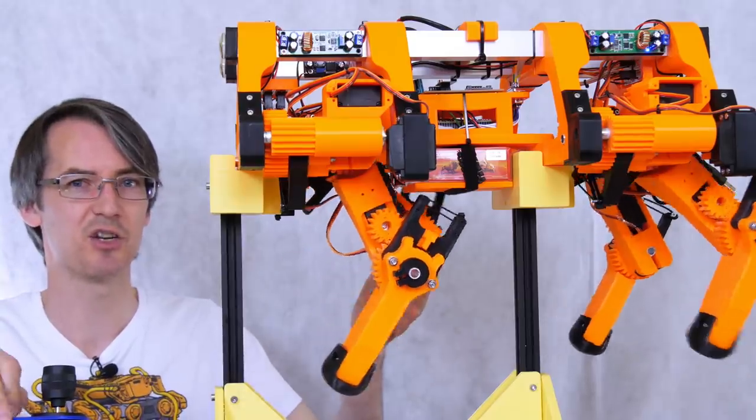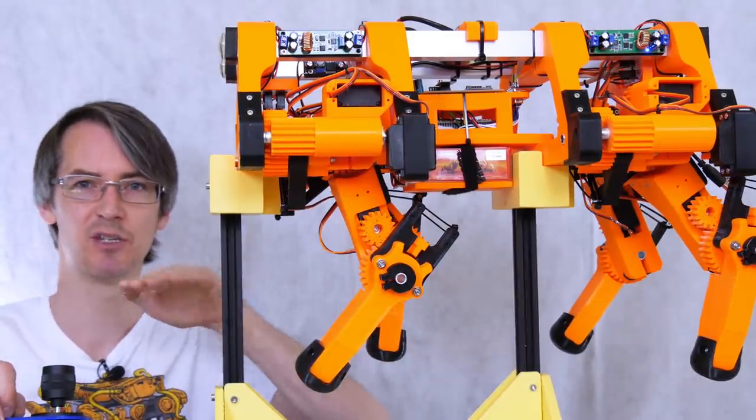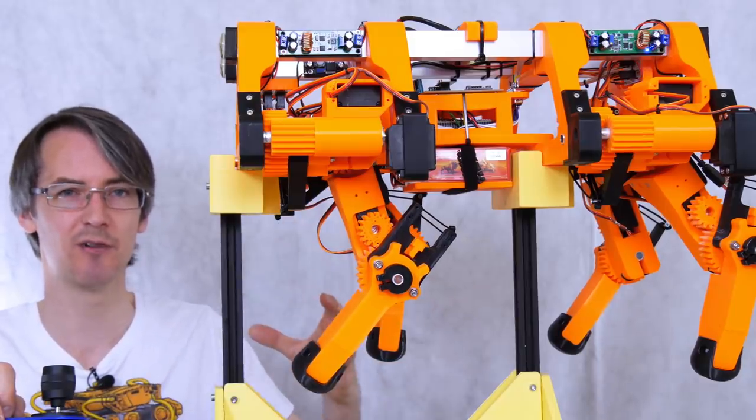And of course, as I mentioned, I'm actually pushing the maximum speed of the servos here, so they don't necessarily achieve their position moving back before they have to pick up again, which is why they do slip as well. So we could try and fudge some numbers there.